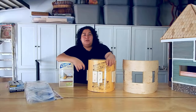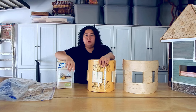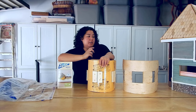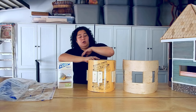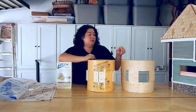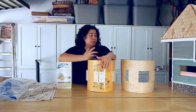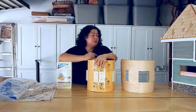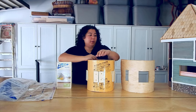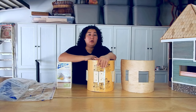In today's episode we are going to be doing some vacuum bending. I'm going to walk you through the process of using a vacuum bag, how to build a jig, and doing the glue-up for a vacuum bend. When you're doing very large long bends like this, it's not necessarily convenient to use the jig method or the two-part bending method with yellow glue, because it's such a long surface and getting adequate pressure is a little bit complicated.